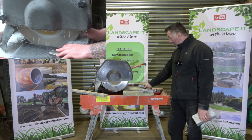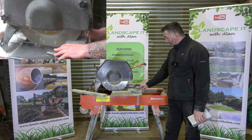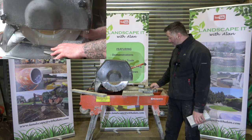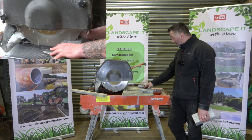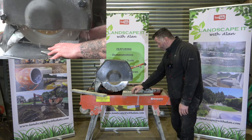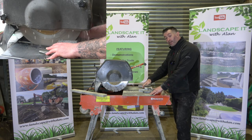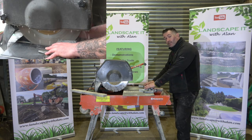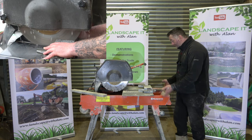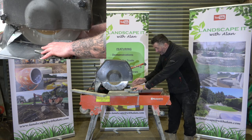So we look at the actual table — this is obviously where the name table saw comes from. There's a sliding table that passes through the blade, so the blade stays fixed. It can be lowered up or down, but it actually stays fixed during the cutting process. Your material is placed on the table. It does come with a lovely gridded or ribbed rubber surface, so once you keep that clean with a little brush as you're cutting, and the material under the bed gets a little bit damp, there is a little bit of suction there and it keeps the material quite safe, doesn't allow it to move around very easily. You're standing at the back of the machine, you hold the material in place, and you proceed to push the material through the blade, creating your cut.